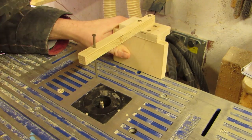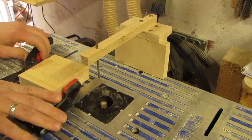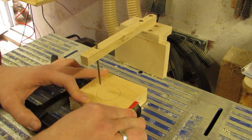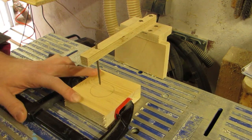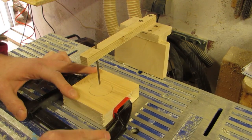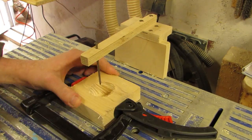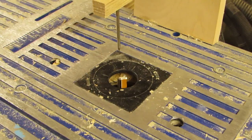The router table! I'm using a pin router attachment I made a while back for a router table sled, which did not work out as well as I had hoped. The idea is to have a point or tip to reference the position of the router bit on the underside of the workpiece. It works, but a pin the size of the bit would have made it easier to guide. And if you do not have a router table, a router in a large enough vise would do the trick too.